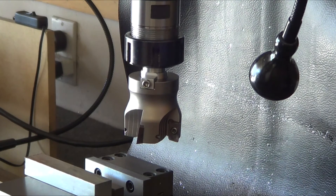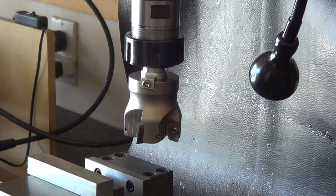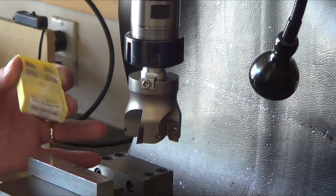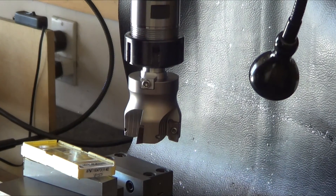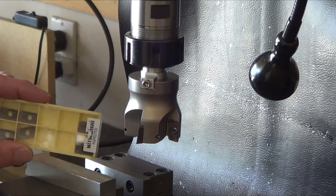What I learned is that mini mills are not equipped for big cuts like this - the whole machine vibrates too much. The smaller the cut, the better - the fly cutter gives gorgeous finishes. Even a three-quarter end mill vibrates the machine too much for facing, but running it over a surface gives a gorgeous finish. The inserts came in a box marked Mitsubishi and sealed, supposedly high quality - and they're not. The seller was Eddistore - E-D-D-I-S-T-O-R - one word. Not a company I'll be buying from again, especially with this kind of runaround on Amazon.